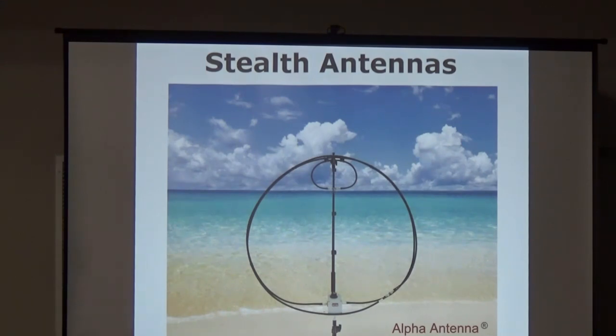They're not the most efficient antennas in the world, but they do work. They get used on DXpeditions all the time. That's just almost standard issue for the DXpeditions. Magnetic loops will work effectively just 36 inches off the ground, too. You can mount one on a tripod, stick it out on your patio, and operate worldwide without the HOA ever catching on. And besides, they wouldn't have any case anyway, because that's not a permanent installation.